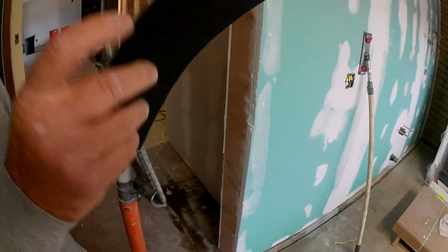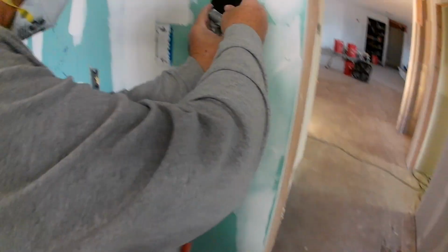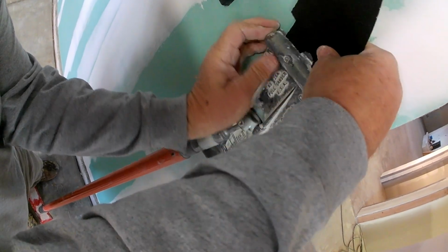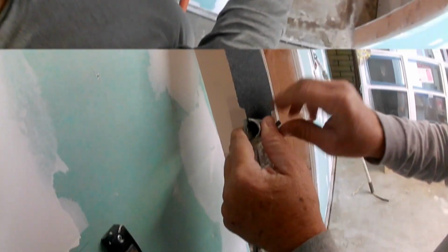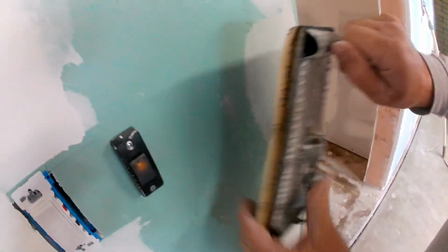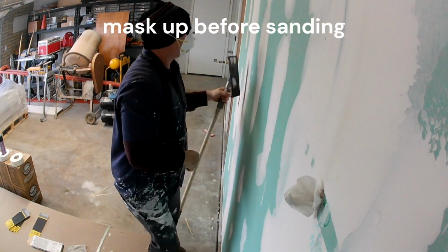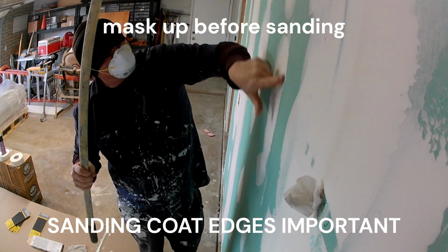Also, you'll see in the video that in the dark rooms we use lights. It's always a good idea when you're sanding, especially in dark rooms, to use lights. When you do smooth wall drywall, they actually have a light you keep behind you because you'd be surprised what you see when that light's shining on it. Sometimes it's not the direct light that shows everything, it's the shadowing. Whenever you're striving for perfection, you're going to need lights with you. Halogens or bright LEDs. You just need a light shining at the wall, and move it around until you see all the imperfections in the wall.